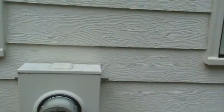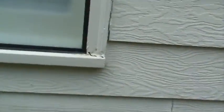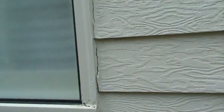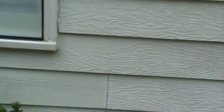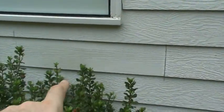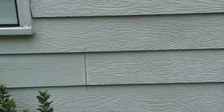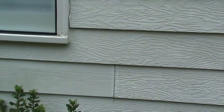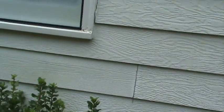We've got rot in all kinds of places on this house. Right here at the master bathroom window, the nose is surprisingly still good but the brick mold is shot. If this caulk hadn't failed, it'd still be good. Here's a jack-leg repair where somebody came in — there are different thicknesses. This little piece is Hardie plank, and the rest is Georgia-Pacific. The Georgia-Pacific is thicker than the Hardie plank, so they jacked the board out a little bit leaving a gap underneath. We'll actually remove this piece.